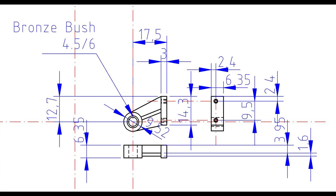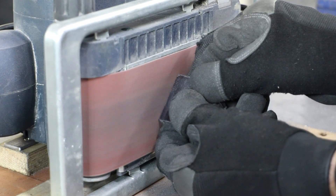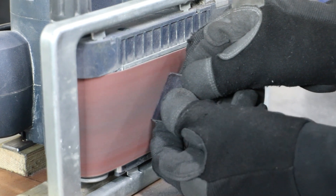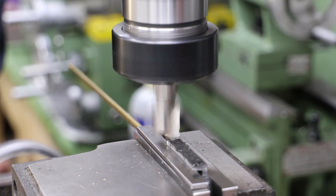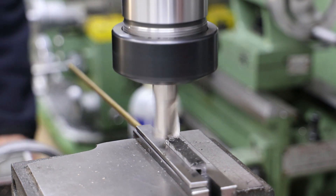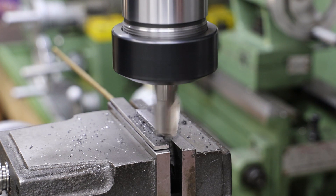It's taken a lot of thinking on how best to approach making these parts, and in the end I plumped for using a bit of angle. I cut a short length of 25 by 3 and used my belt sander to clean up one of the faces. The base is only 6.35mm across, so I cut off a large chunk of one side and then squared that face up in the mill.